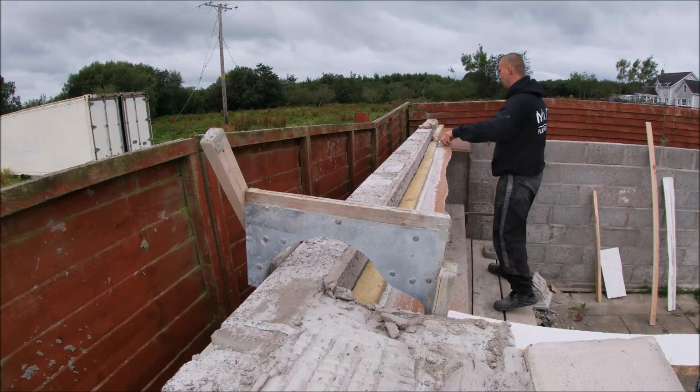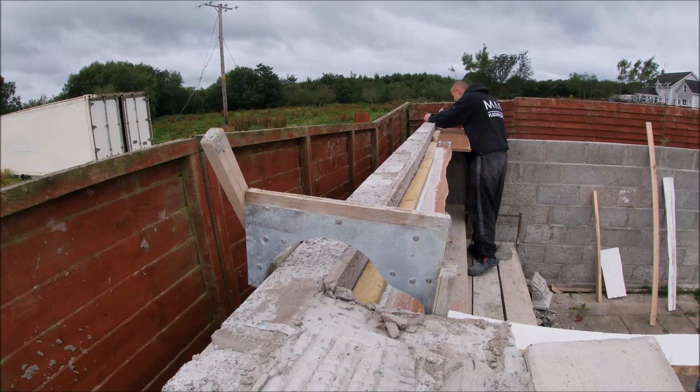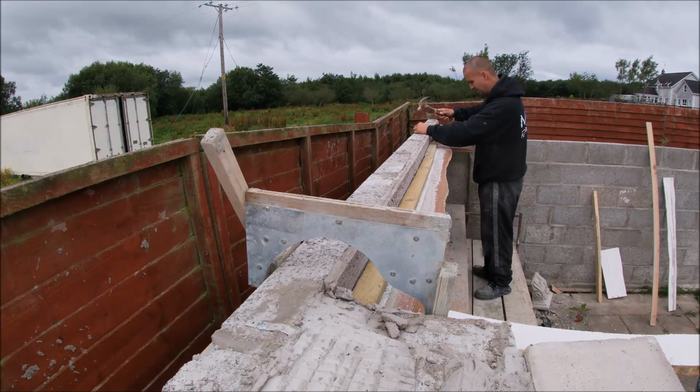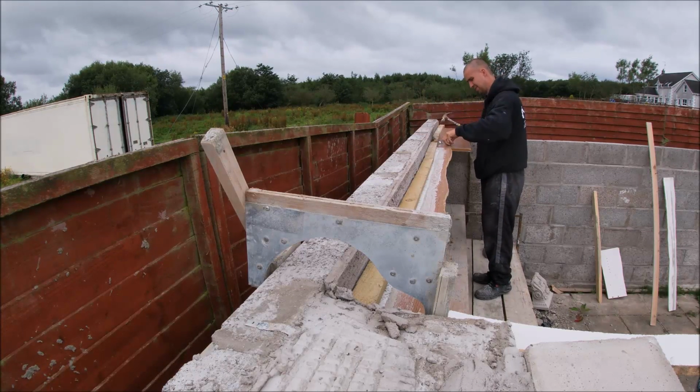So I actually had to put a grinder up onto the batten and cut my nails and fixings so that I could release the timbers down. That lesson was learned very quickly, and I didn't do that again. That also caused me to damage the coping stone in 2 different places, which I had to repair, but it repaired very well, as the render was pretty green when I repaired it, so not too bad.